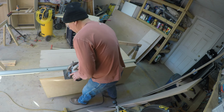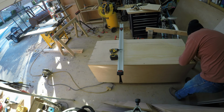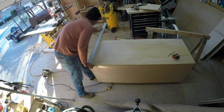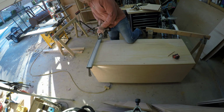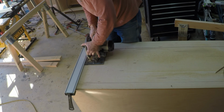One important point for this process is to have a good fine saw blade for your circular saw, definitely not like the sorry one that originally came with this saw, because as the blade is rotating, it's moving up through the wood, and so you have a potential for tear out on the visible side of the plywood without a good blade.